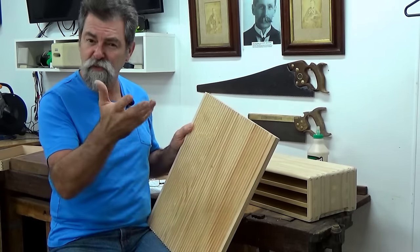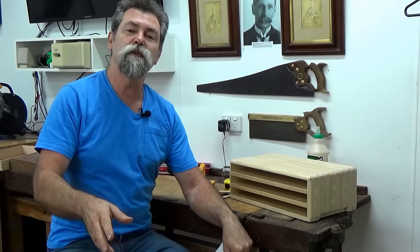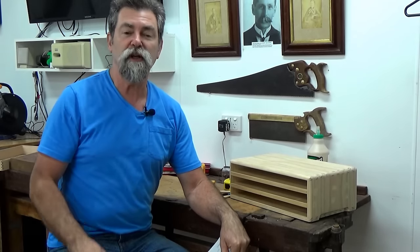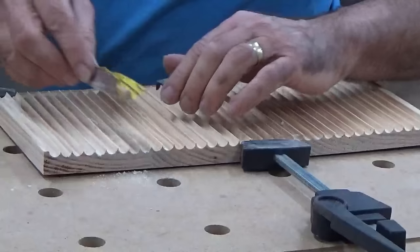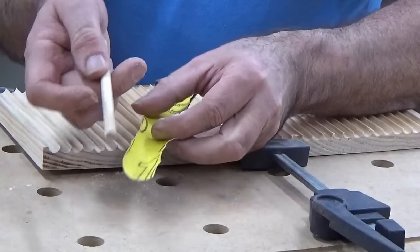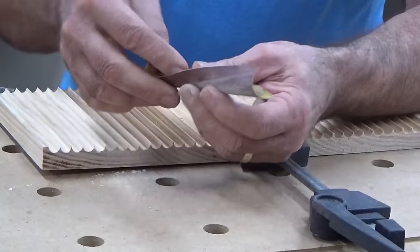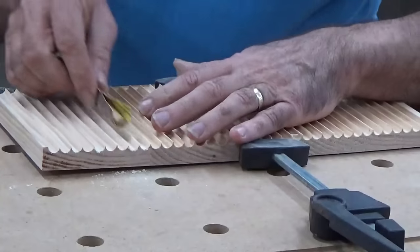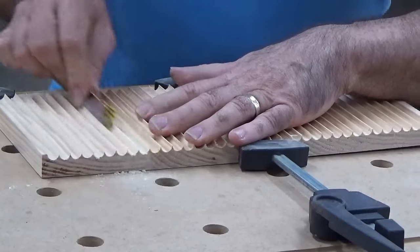While making this cradle on the router table you will see a lot of furring happen — that's not to worry. What we can do is get a piece of quarter-inch dowel and some 180-grit sandpaper and sand all of these individual channels — or whatever you'd call them, slots, trenches — they're a semi-circular slot.